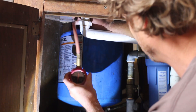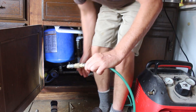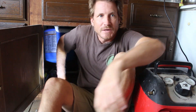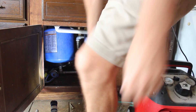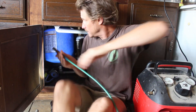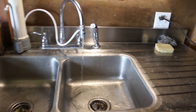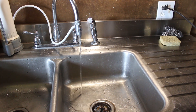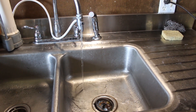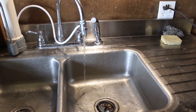There's like no pressure in there right now. I added some pressure and now you can see it's pushing water out of that tank. We're going to keep on adding pressure until all the water gets pushed out of the tank, and then we'll get that final reading. Once all the water has been pushed out, we'll know that the tank bladder is actually at the proper pressure.